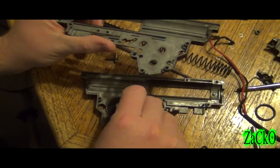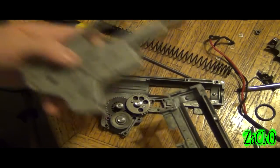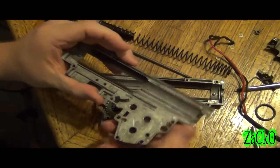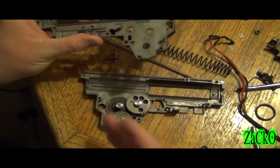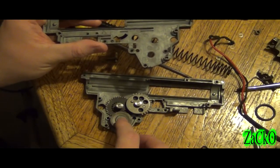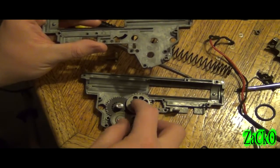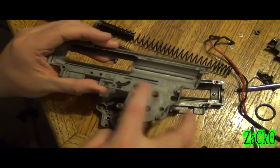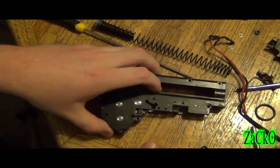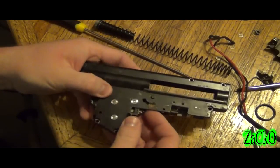I remembered that every time I go to install bushings, I do this check now. If I can get the bushings stuck to the shell, hammered in like this, then that's an easy check. I just put shims real quickly — I put a 0.2, add some shims on this, put 0.4 on the bottom of this — and then I just add shims on top until these literally stick into these bushing holes.